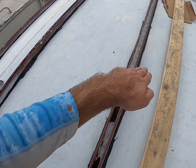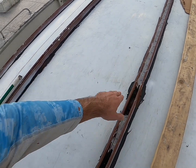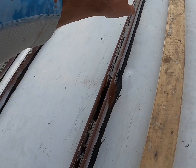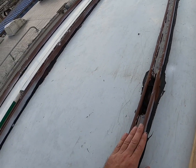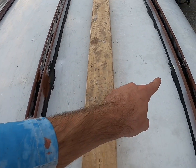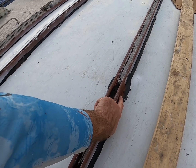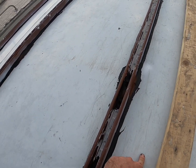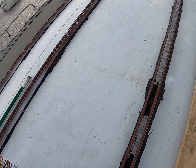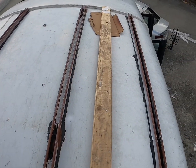Our bus is on a downhill slant, so if water gets in here it will go downwards. I drilled holes right before all the bolts so that if there is enough water where it's puddling in there, it will hopefully drain out and go towards the front or run down. Anytime you drill into steel or metal, make sure you're putting a primer on it — same thing we did when we drilled into the roof of our bus. We hit it with some primer. Moisture and raw metal and steel don't go well together. Now all I've got to do is paint it.